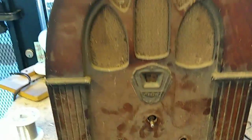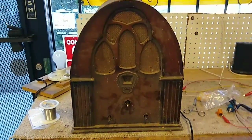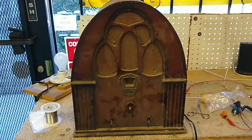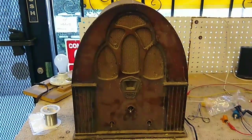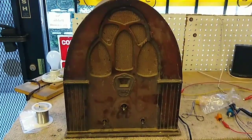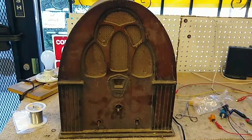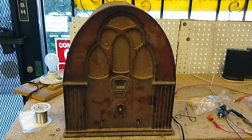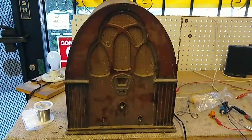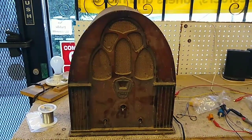I'm really stoked about that. So obviously I've got to put a little dial lamp back in there, clean up the cabinet a little bit, install the power switch back on that side. But look at that - I couldn't find any prints on this thing, so it just came down to experimenting and figuring out how to properly tweak things around the busted controls so that I could bias the tubes. It's still a little touchy, but this guy just wants it to turn on and play - so it's not like a mission-critical type thing. I'm pretty stoked about this. Maybe when I get it all back together in a final video, you'll be able to see it all cleaned up with a light and working much better. I hope you guys enjoyed this portion of the video, and more stuff to come.